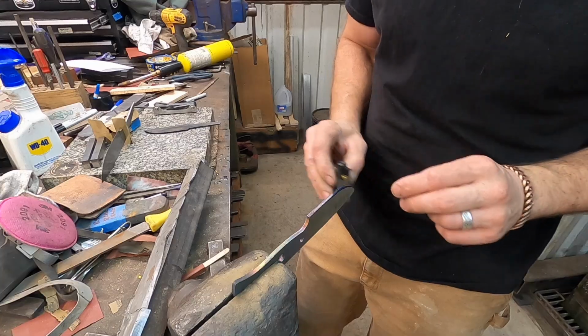So all that to say, I don't see anything wildly out of order that would require going back and repeating the heat treat process. If I was trying to dial things in really close, I would, you know, do a little more careful prep of the steel surface, etc. But I just want to make sure that we're in the ballpark, and by that I mean like a couple of Rockwell points at most, and that's kind of where we're falling in the middle there. So I think we have a good heat treat on these to proceed and see what we think of the steel.